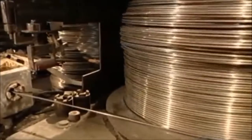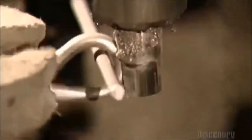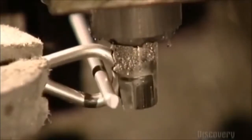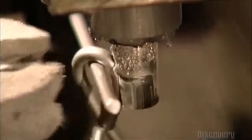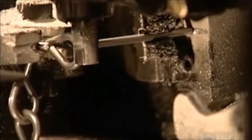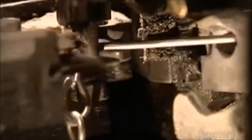The wire hardens and becomes stronger. Now electrically driven tools move in from all sides on a forming machine. A tool called a jaw propels the wire forward while another jaw pushes on the wire, bending it around a steel pin — it forms a C-shape. Another forming tool closes the C, completing one link in the chain, and then another jaw makes the next link.